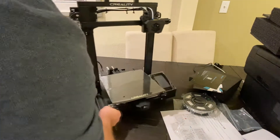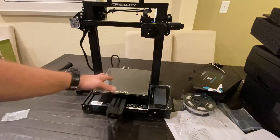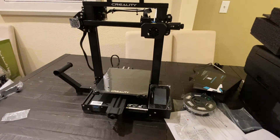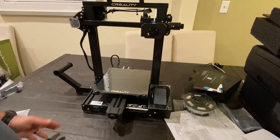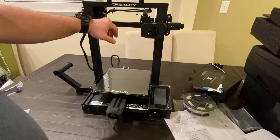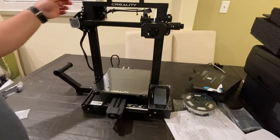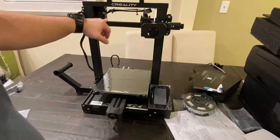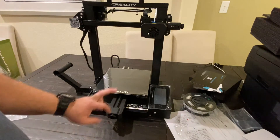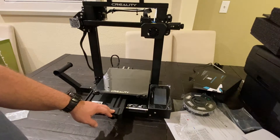So a few things that make this a really cool printer. The reason I wanted it wasn't the build volume — the build volume is pretty modest, 235 millimeters by 250 tall — but they've included a few features that are pretty handy to have. First and foremost, you do have tensioners on all the belts. You have an X axis and a Y axis tensioner right out of the box, which makes it super easy to tension your belts properly or adjust tension if needed.